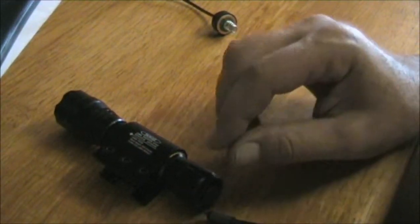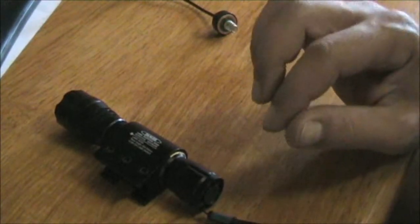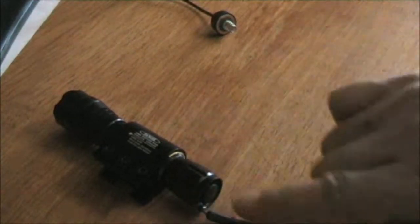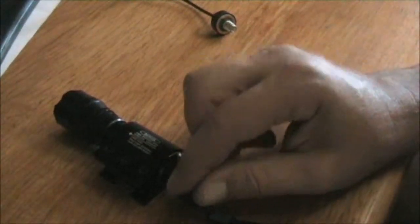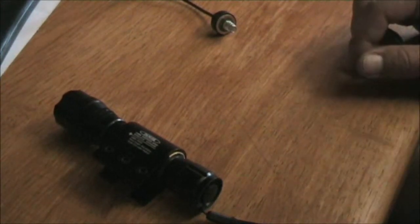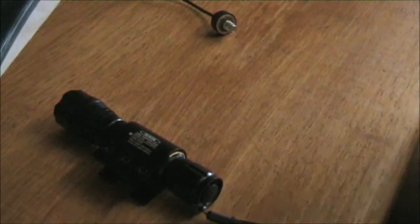When you take that switch out, that little metal tab can cause the switch to cock in the housing to one side, so you need to decide where the little tab is and push it out first as the tail cap gets hooked up on it.